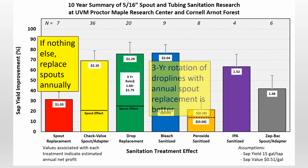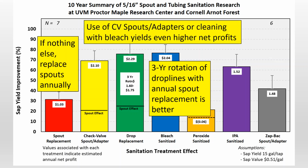What did you use to clean your line? What we've found the last 5 years is that at the end of the season, we take the spout out of the tree, cut the last year's spout off and plug it on the tee, and leave the remaining sap inside the lines so it can do its own cleaning. Those sugars start chewing everything eventually. We do end up dumping a little on the ground on the first run, but that gets the gunk buildup out of the lines.